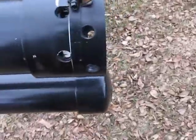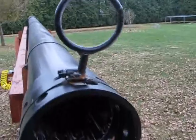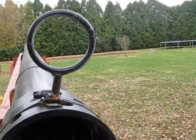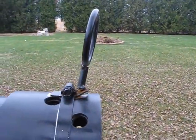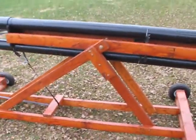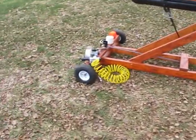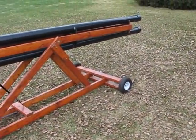You can see right here that's more cosmetic than anything — the little fake muzzle brake on here. And here's my sight, which is just one of my stainless rings that I use in my weight work — I just welded it to a piece of bar and clamped it on there. It has actually bent itself slightly because of the weight of it and the actual recoil of the cannon. Even though this thing weighs about 250 pounds, the recoil is still fairly great. Shooting my tungsten shot, this thing will kick back about 5 or 6 feet, especially since I have the wheels on it.